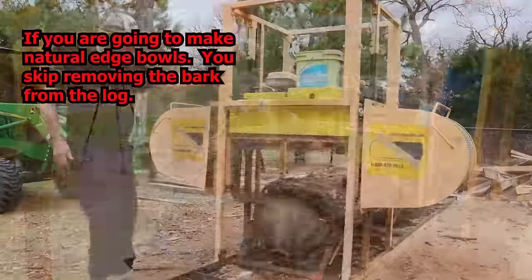All right. I have a little bit of bark inclusion here, but I've got some nice spalting I'd like to see. And it looks like, by fudging a little bit here, I can capture part of that spalting and probably deal with the imperfection in the wood just by taking maybe a 1/2-inch off my bowl. And that is an 8-inch bowl. Now, we'll come down here. There's some beautiful wood right there. Let's see if we can get... Now, I can do that. I can get a really big bowl out of it.